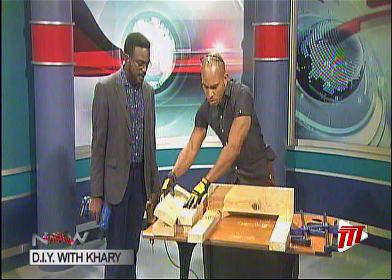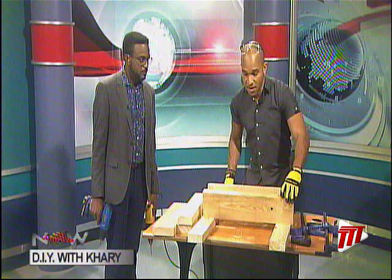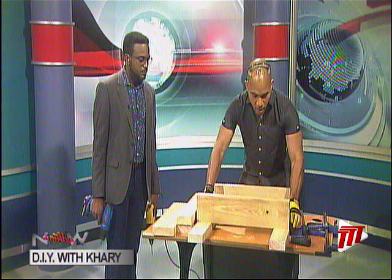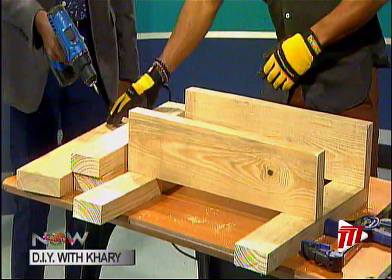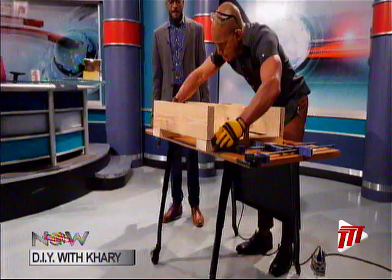You had marked - what's the distance? On each side, the thickness of these pieces is actually 1.75 inches, so I marked 1.75 from the top and from the bottom. Then I got my center line here. I do want a little more space on the bottom shelf between the bottom and middle shelves, as compared to the middle and top. So I'm actually going to go above that line. And once we get that in place, we could then put the other legs on the flip side and clamp everything together. I now see what we're doing here - the math's adding up.